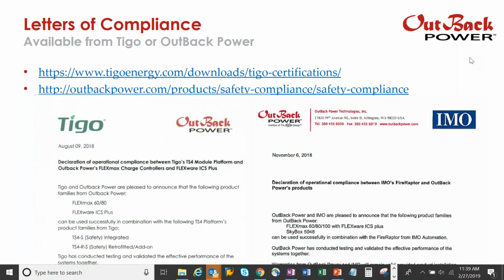All right, a couple more here, it looks like. Does OutBack have any products that address DC arc fault requirements, which started in 2014? Yes, the RSD-AFCI addresses that arc fault. It is compliant with 2014 NEC. And then, of course, the Skybox is going to have the latest arc fault requirements to match those high standards.